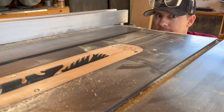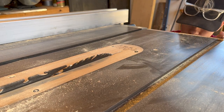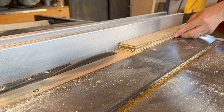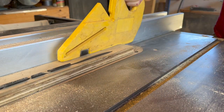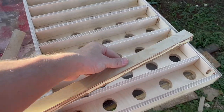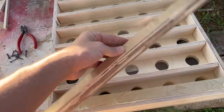To hang it on the wall, I'm going to be using a French cleat. If you're familiar with a French cleat, you'll know what I'm doing here with my table saw. But if you're not, all you need to do is take one board, rip it in half at a 45-degree angle. Then when you go to put two pieces back together — one on the wall, one in the piece — they will match up perfectly and your piece will sit flush on the wall.